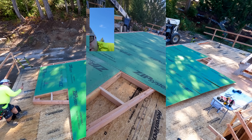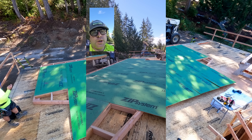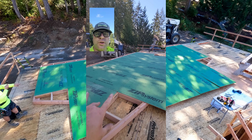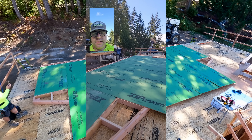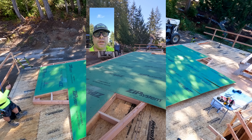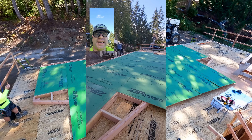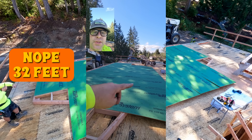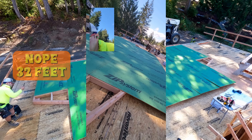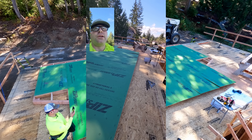Some of you might be wondering how come we've not staggered our sheets. We don't need to — why would we? This wall only needs three sheets, maybe four, to meet lateral loads. And we have — what was this? 48 feet. So we got six running that way, plus all these. Everything's connected, solid block. This is going to be a way stronger wall than it ever needs to be by like nine orders of magnitude.